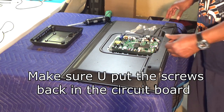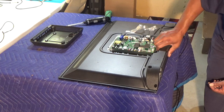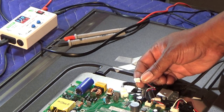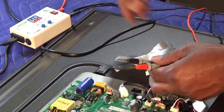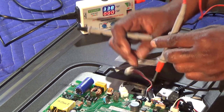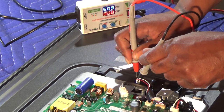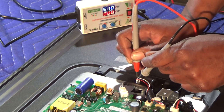Now let's see if we can get the bottom piece to come off. This is our plug for the LEDs and I'm going to check it with my meter. I just unplugged it — going red to red and black to white. It went up to 51 volts but I still don't see any backlight through the back of the TV.